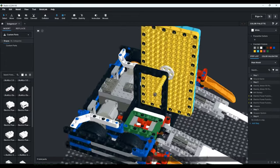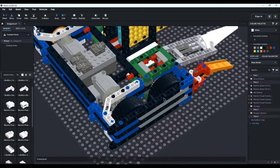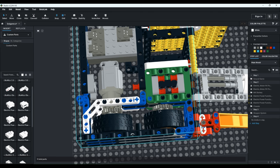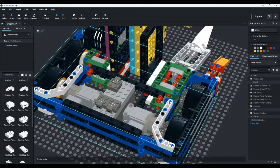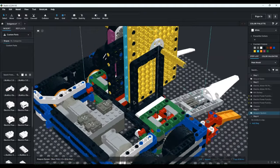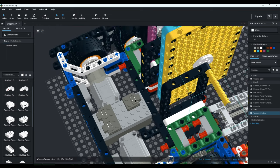So, this thing had a lot of issues, the first one being the fact that it couldn't self-right if it got flipped. So if it ever got flipped, the fight was basically over. Second issue was that it used chains. Chains are notoriously unreliable. Sometimes they work great and sometimes they just immediately break in the fight for no reason. And then the third main issue was that the weapon was super, super close to this wire right here. When it gyroed, it would clip the battery.